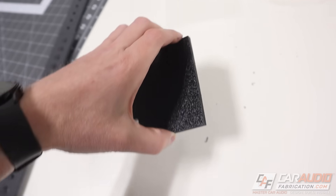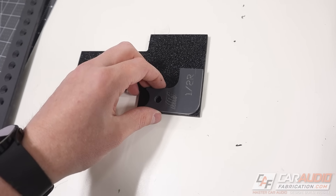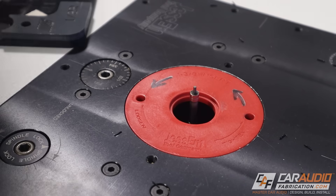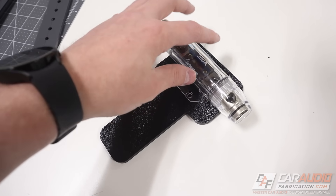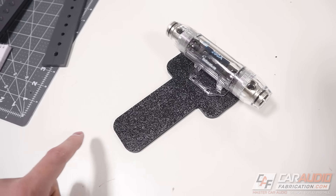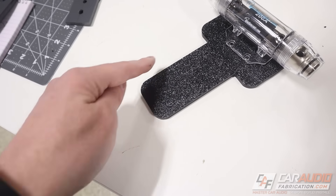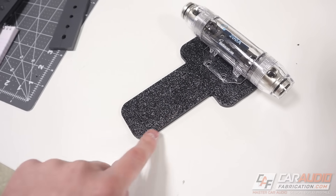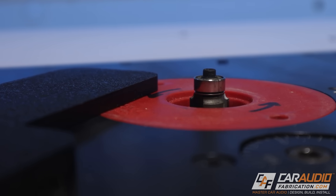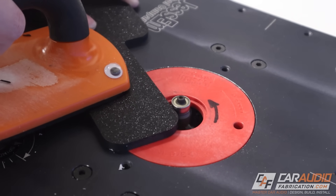Right now these corners are pretty sharp, so I'm going to use a little radius template, template tape it in position, and flush trim each of those corners. This takes a little bit of time but gives me a much more finished piece. We're getting closer to a completed bracket — we still need to bend it at some point, but it's important to do all the machining before any bending. The top and bottom edges still have a rough feel, so I hit those with a round over bit on the router. The round over is super small and most people probably wouldn't notice it, but these tiny little details give the parts a really finished feel.